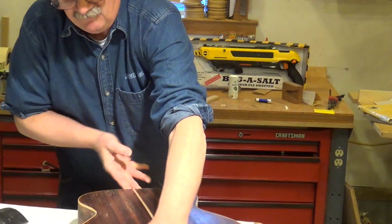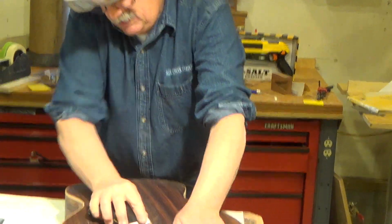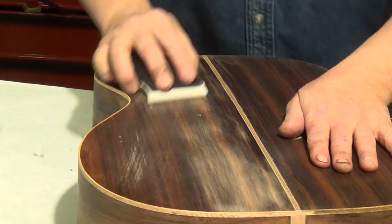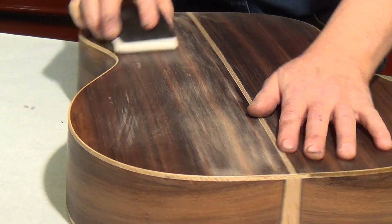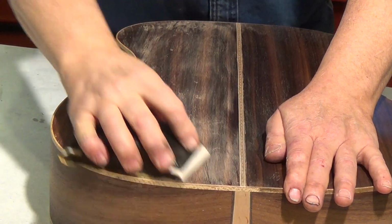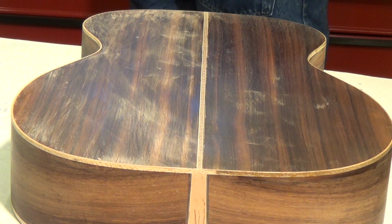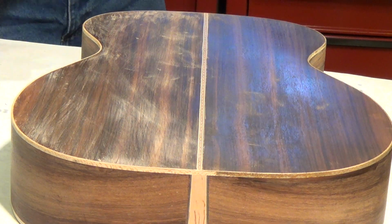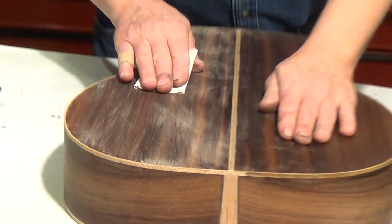Okay, now I have 180 grit on here, and I'm going to try to be careful, remember this is a demo, so I don't want to go across my line. 180 grit. Okay. And look at your sandpaper often, when you see that glazing over, okay, get a new piece of sandpaper. Okay, I fold it in thirds.